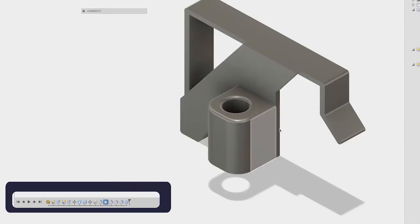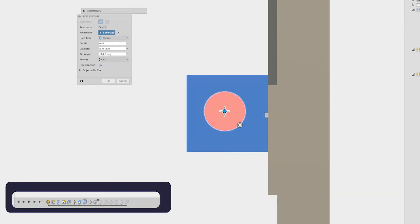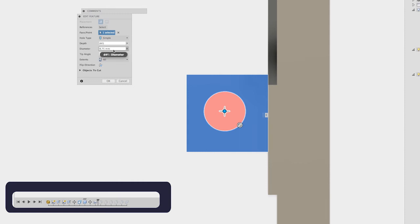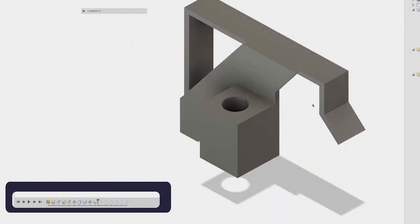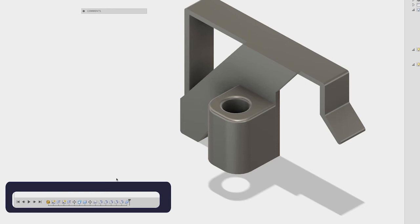Now let's determine what the hole size should be. Coming back over here — when I made the hole, looking at it from the top, here is my diameter setting. So if you download this file and find your dial indicator for your Tevo is thicker or thinner, you can use a micrometer or digital calipers to measure it, then come into this step, double-click on that value, and change it to match your particular situation. Then you'll have your custom size. If you're using a Tevo Tornado with a different size mount, this should work too — it should be super simple in Fusion 360 to make that change.